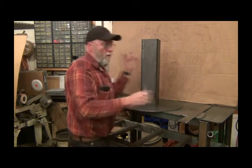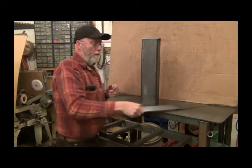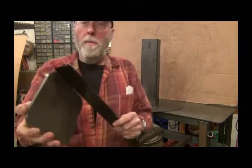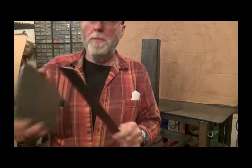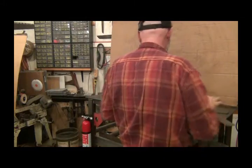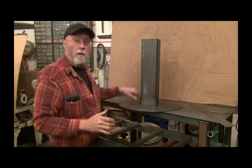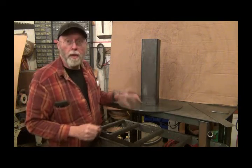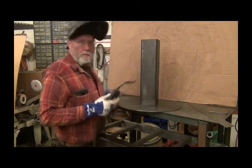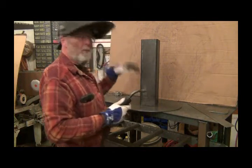I've got to tack this down. I've also burnt out a lid for it and I have some thin material here — I don't know if it's 16 or 18 gauge — but I'm going to weld it on here and bend it all the way around so I have a flange to keep it from falling off, and I'll probably drill a hole and put a little knob on it so I can pick it up. First thing I've got to do is get my welder set up. I do have a fire extinguisher handy, so let's see what I can do here. I'm going to tack it down first.